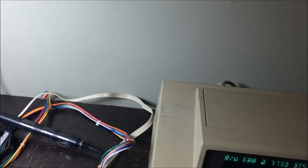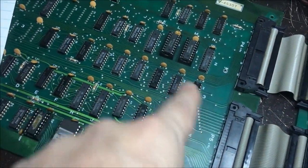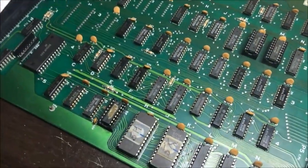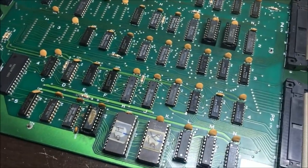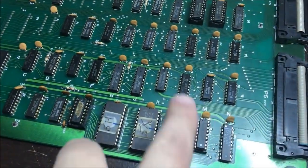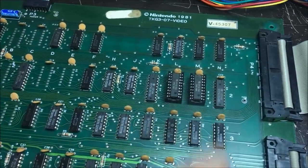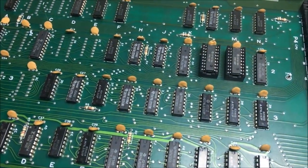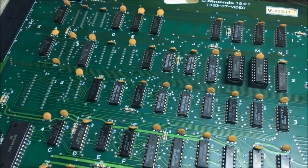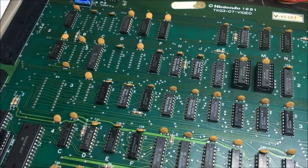And then I'd like to, these muxes right here are the ones that are in that schematic. It's this block, I believe. I think. Now, remember, that's a 2-board set schematic. So I got to make sure that, and I do believe that these are the muxes that work with this stuff. You know, I got another 245 up here that works with these two RAM. And I got some 157s here. Probably half of them are for this and half of them are for that. It's probably these 3 are here, these 3 are up here. Probably. I would imagine it's something like that.